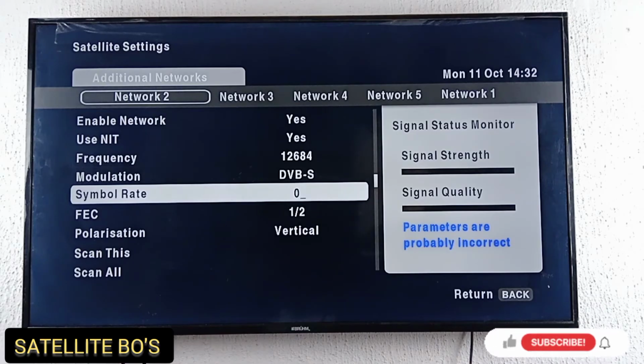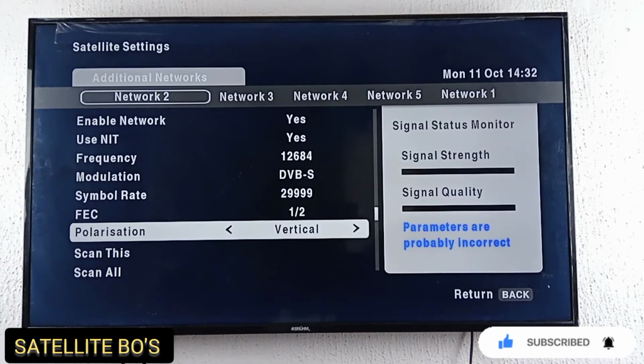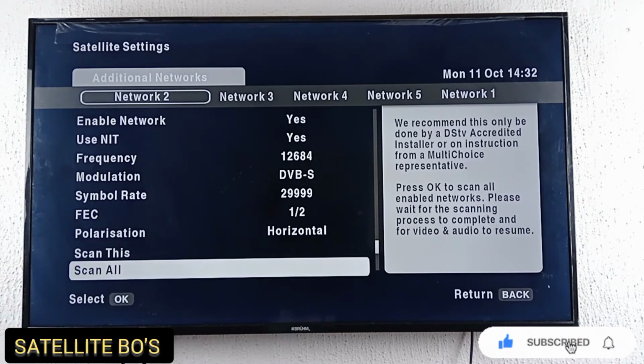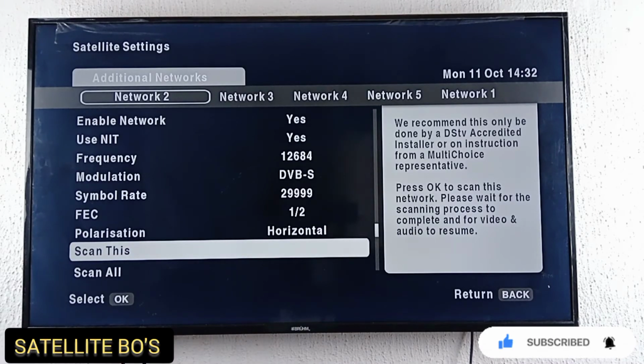Let's go for 12684, then symbol rate is 29999, then the polarity is V, all right, no, it's H, sorry. So you go to polarization, put it on H. You see, the signal strength and the signal quality are there. So just go to scan this, and press OK. And wait for it to scan, all right?